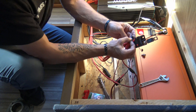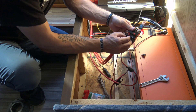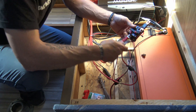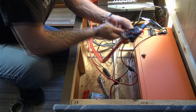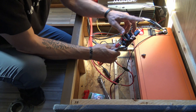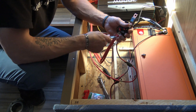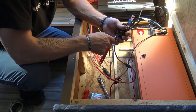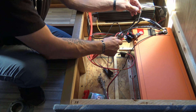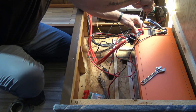When I make this connection and touch the positive terminal, there is going to be a spark. That spark is because there are capacitors in the power inverter that need to be charged. So be prepared to see a spark when you make this connection — don't get scared, that's totally normal. Let's go ahead and make that connection — there it goes.